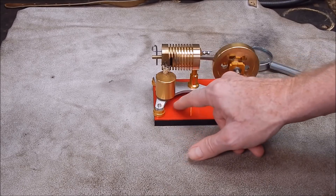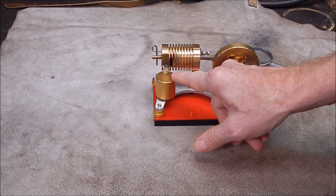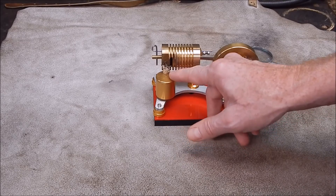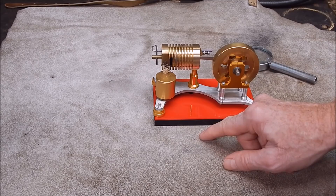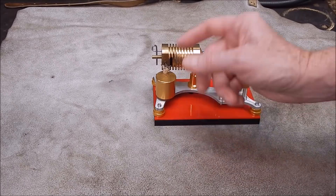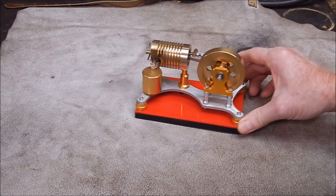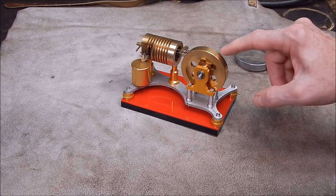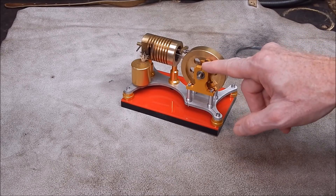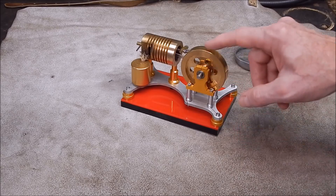You couldn't just move that one and mount it down there and put a spout on it — it's still not big enough. Those are the things I want to do. And then hopefully when the flame's down lower, I think it should run better. As was pointed out by a guy who was a lot more experienced in flame lickers than me, that flame should be down more — it makes a lot of sense. So first thing is going to be to dismantle this, take the flywheel out, have a look at it. I'll probably have to bore it out, bush it, and then re-bore it all square on the lathe.